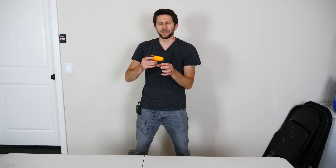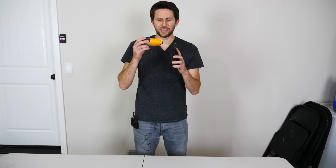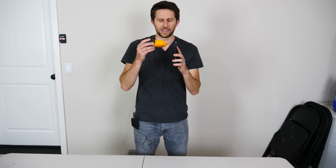Now for my cell phone I was directly on top of it. If I actually move it away from the cell phone then I don't get within that range of five milliwatts per centimeter squared. So if I stay around two inches away — that information may or may not be comforting to you, because if you remember when you talk on your cell phone you're sticking it right next to your head. So who cares about that two inches?